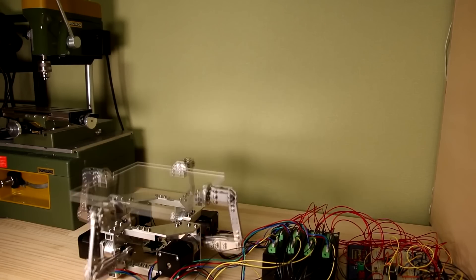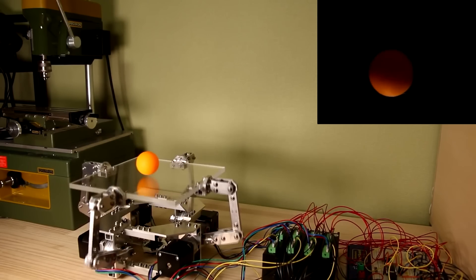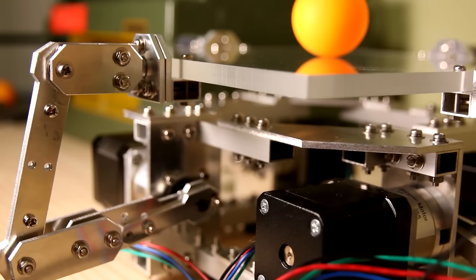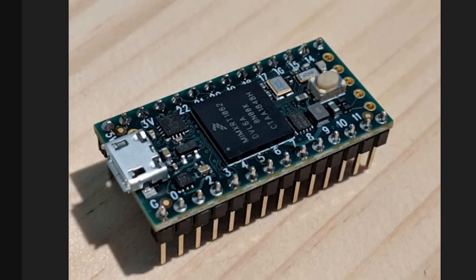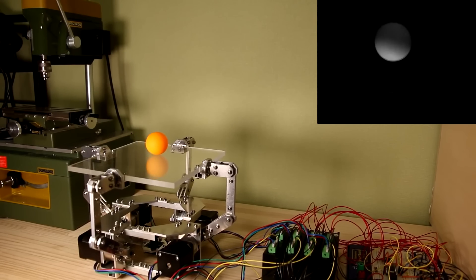Tobias Kun has been on a five-year mission of building machines that can reliably juggle a ping pong ball. His latest and perhaps final build of these ball-bouncing robots is called the Octobouncer. You can boil the robot down to four stepper motors and drivers and a single Teensy 4.0 microcontroller running Arduino code. The Teensy was chosen for its maximum clock speed of 600 megahertz compared to a more common 16 megahertz Arduino speed, which is what allows it to read and react to the ball so quickly.